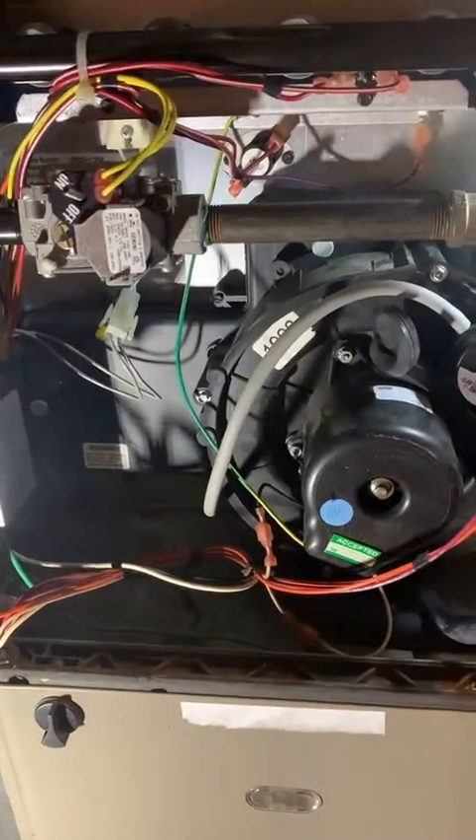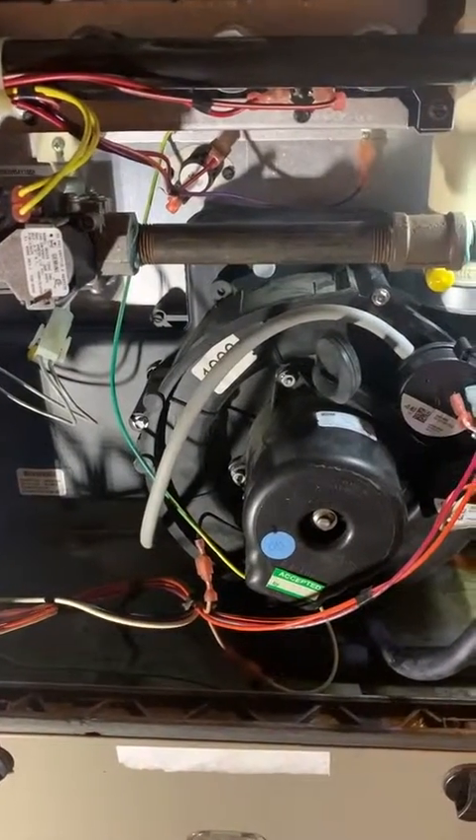And there we go — that's the sound I like to hear. Gas on, gas on, gas — that's it, job complete. We'll let this one dry out and keep a watch on it for a minute, make sure we're not leaking at all, but I think we did it. Just finished up the drain pan swap on that York — turned out pretty good. Got here at eight o'clock — checking the time — it's 8:50. So I did a condensate drain pan swap and a pressure switch swap in under an hour. Boom.